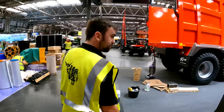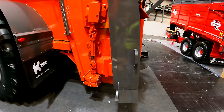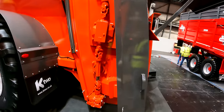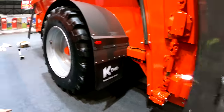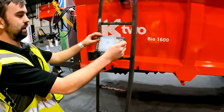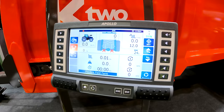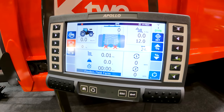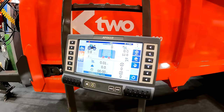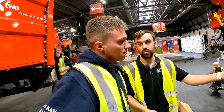The Bio uses a gearbox driveline with a slip clutch system — a good positive drive with very little problems and a very strong robust driveline. The screen can be set up on the side: you type in tonnage per hectare, drive forward, and the spreader figures it all out, telling you if you need to slow down or speed up. It's also ISOBUS compatible, so if you have an ISOBUS tractor you can plug straight in and use GPS and mapping.